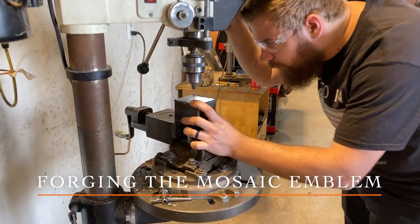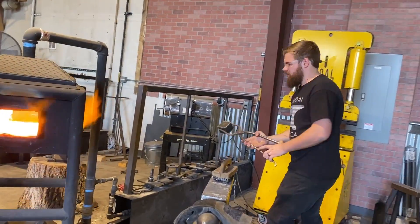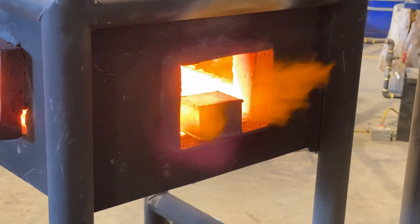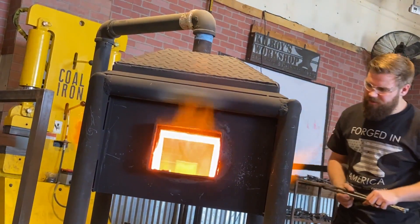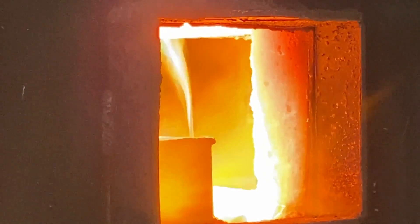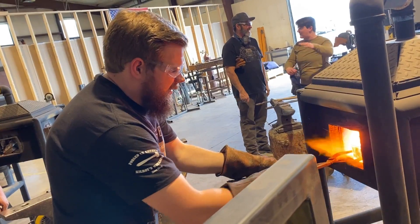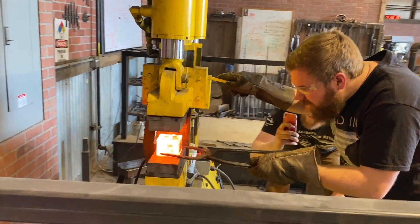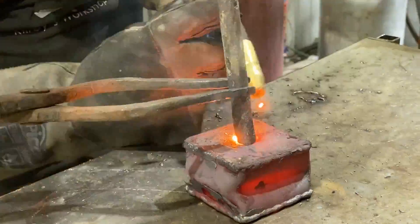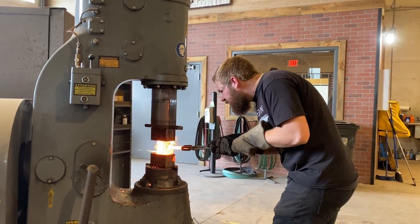At last, Ben is ready to work his magic in forging Fingolfin's symbol to life. He starts by creating a small divot hole — this allows for some of the vapors and specifically the plastic PLA to burn out. Ben intentionally places it on the edge of the forge and leaves it there for a good long while to allow the PLA plastic to burn completely out. This process cannot be rushed, though there's plenty of time for banter in between heats. When Ben knows that it's up to the proper heat, he carefully brings it over to the Coal Ironworks 25-ton press and gives it one solid squish straight down to ensure that the canister is compressed as best as possible. He then quickly welds on a handle to make it easier to work from different angles, and we're back to the fire and forging.